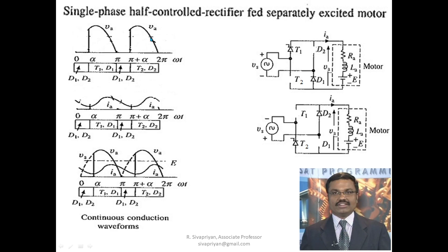From pi+α to 2π we get the armature voltage, and then the input supply enters the next positive half cycle. The inductor again switches its voltage — downside becomes positive, top side becomes negative — so D1 and D2 become forward biased and freewheeling action takes place again. From 2π to 2π+α the armature voltage becomes zero, and the armature current starts decreasing.